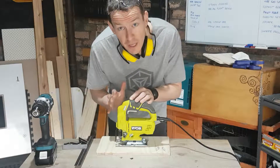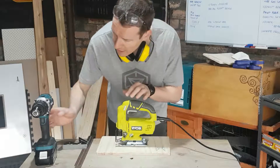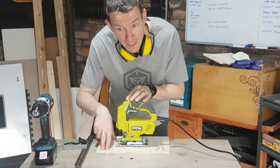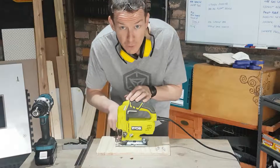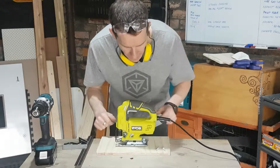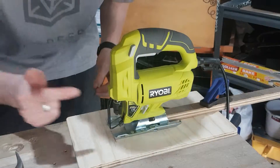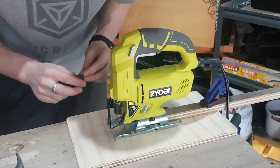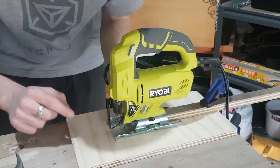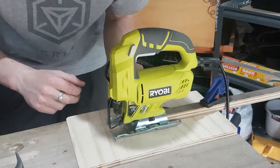The only thing that scares me slightly about this is the first few holes, which I'm going to have to drill through the metal of the jigsaw in order to mount it here. I mean, it shouldn't be too bad — I've already figured out I can smooth metal pretty easily for when I take it off again. I've clamped the jigsaw down as best that I can. I'm just going to use a hammer and a nail in order to mark off where I want to drill my holes. I'm going to do a small pilot hole and then a slightly bigger one for the screw.